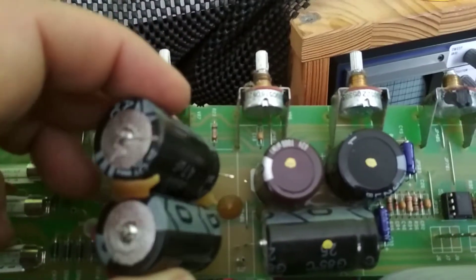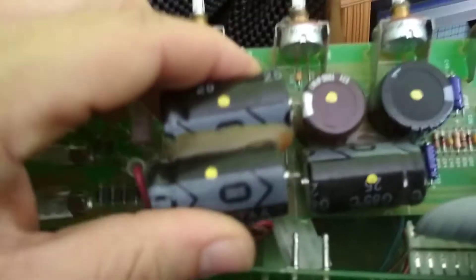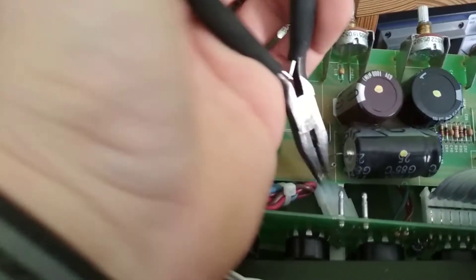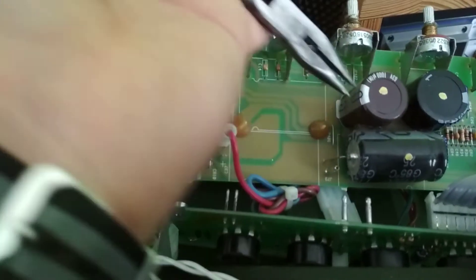Handy tip for your home players: once you have finished discharging these capacitors, they're probably glued onto the board as you can see here. So rather than trying to unsolder them and trying to pull them off and fight them, just snip the ends — snip them off the board. They're useless anyway, so then you'll have posts sticking out. Just get in there with a soldering iron on the other side and a pair of tweezers or some side cutter pliers, and pull the pins out.